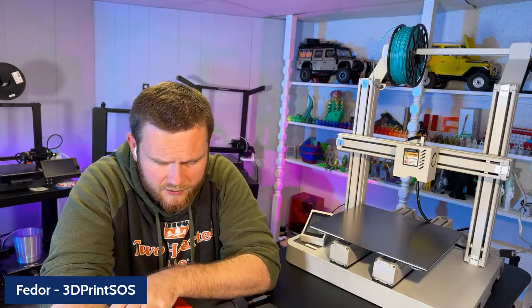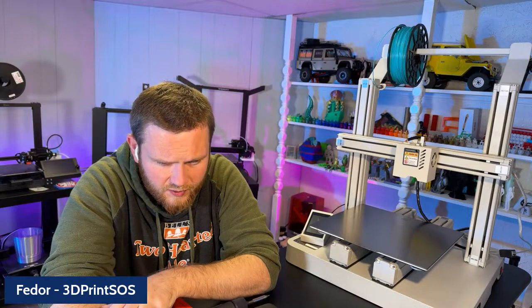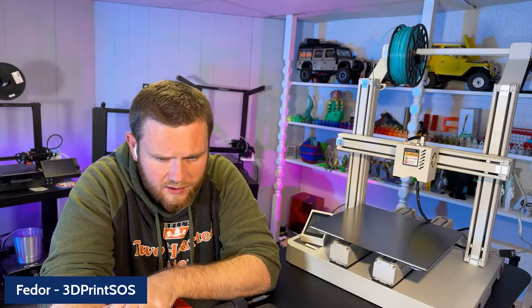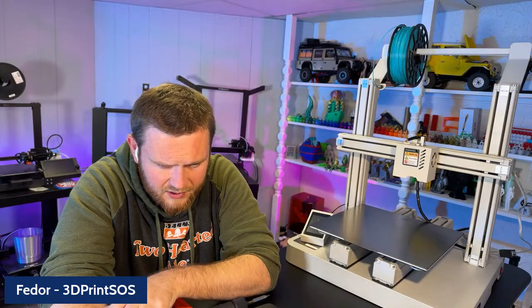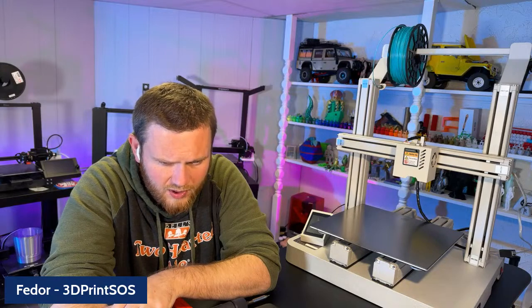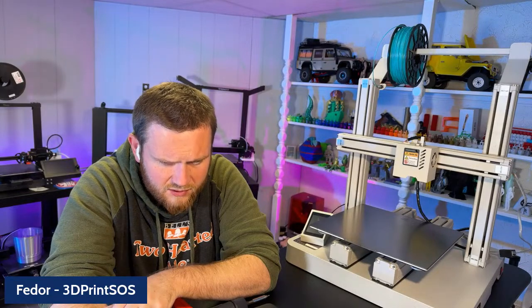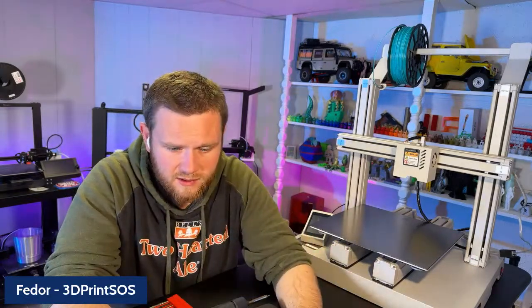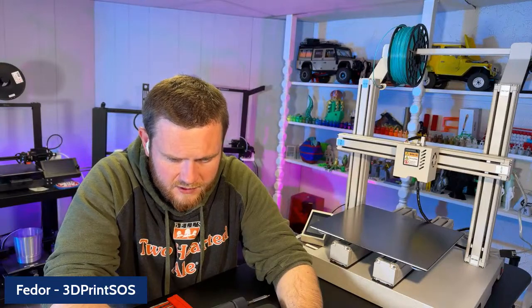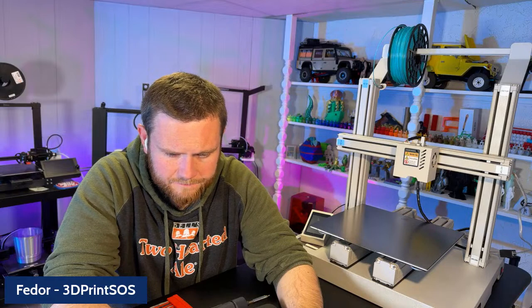Yep. Okay, another tip: when the auto level is completed, the nozzle should hover about 20 millimeters above the heat bed. You can then click the minus symbol to lower the nozzle, go to the position of the hotbed, and at the same time, put a white paper on the hotbed and adjust the traditional way. When you think the paper moves with some resistance, you can click save on the screen, and then you're done auto leveling. Okay, so far that sounds great. Let's do all of that first. Let's get back to the stream. I opened so many windows.